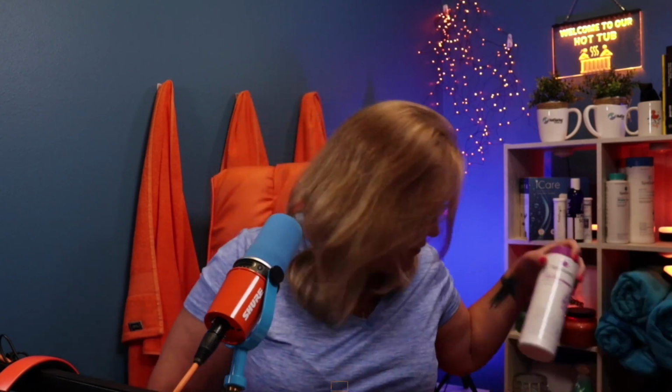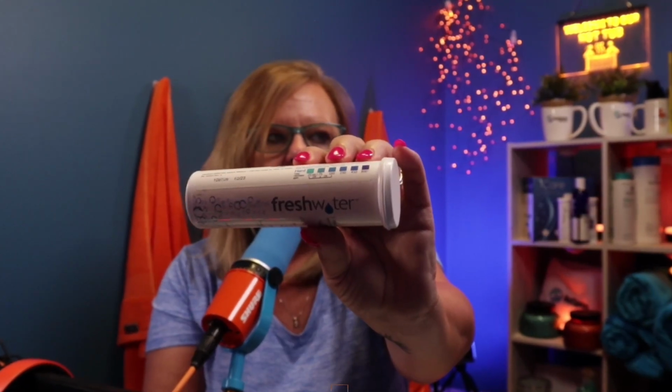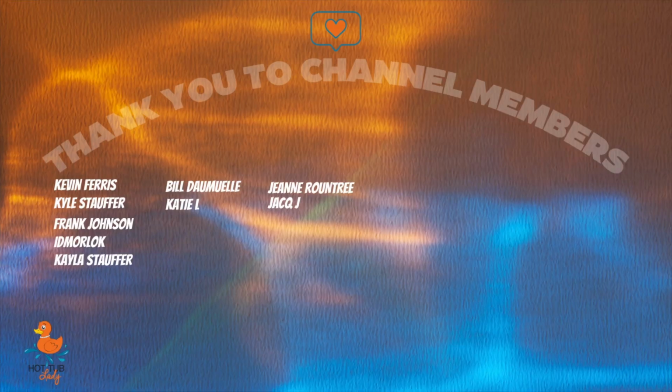The next thing that you do need to worry about will be your hardness. Again, if you look on your test strip, it does have a scale for where you want to be. On a chlorine, bromine, spa frog, any of those types of hot tubs, you want your hardness to be between 150 and 250. Now, I live in a market where that is impossible to do. You cannot get that hardness down without buying some auxiliary products, something like the On-the-Go water softener, and I'll put a link for that down below, or the Vanishing Act, and I'll put a link for that down below as well. Those are two really great products that lower your hardness, and they work really well. But they're kind of expensive for what they are.